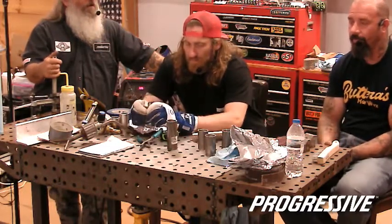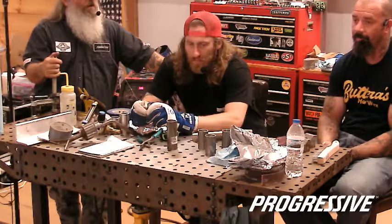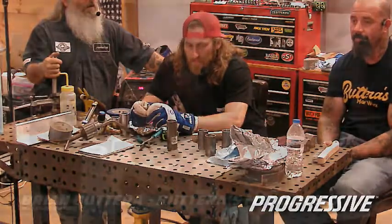Critical welds and stress points, I do a double pass, a root pass, and then a cap pass. I've drilled into my frame for mounts and things where I see the back side of the weld and know that I have proper penetration. And from my experience and understanding of stainless, for what I'm building, I think it's sufficient from a structural standpoint.